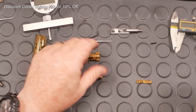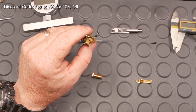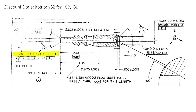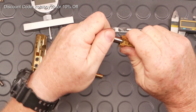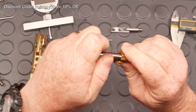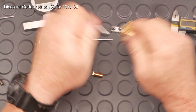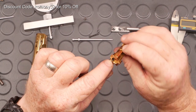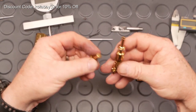This is why I brought this old bolt down — look at this carbon buildup. Clean your bolt, folks. The bolt face — on the drawing we're looking at 0.380 plus or minus 5 thousandths. My actual measurement is 0.382. I want to show you how tight the tolerances are — I can compress the ejection spring and it fits in there, and when it's in there you cannot move it from side to side. Up next I'm going to get a pin removing tool from Brownells. That's pretty much it on the bolt itself.